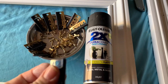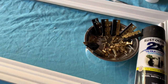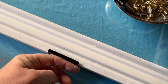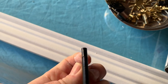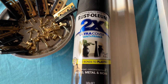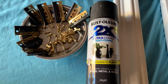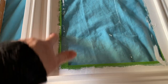We are ready to put the hinges back on. The next video I'm going to show you how I take the tape off which is easier for me and how I get some nice clean edges. Here are the hinges. The only part that you see is that little bit there. I've just sprayed them — one coat using Rust-Oleum 2X coverage paint and primer in black. It bonds to anything and it's only about $8 a can, which will probably last me a full year. Easy to do.